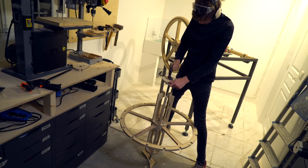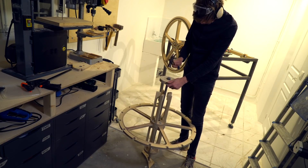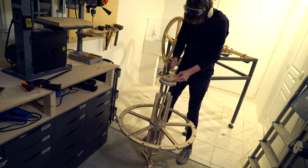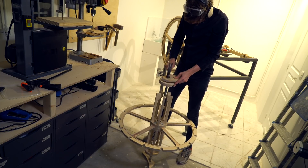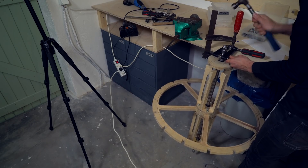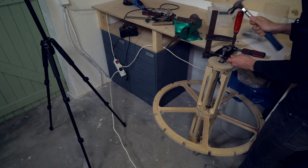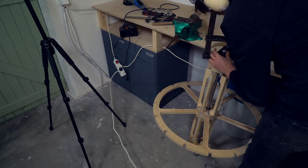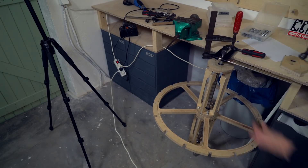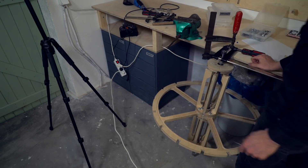Here it started to go very wrong because the tolerances on the shaft are very tight, so I'm inserting a bearing here, but I'm also using a spacer block, and this spacer block got stuck on the shaft. So I made this contraption to try to beat the shaft out of the spacer block, and when you beat at the end of a metal shaft, it will expand at the end. It's called mushrooming, and I just lost my head here and continued to beat on that shaft, and that was really, really, really stupid.